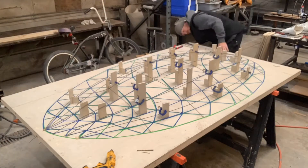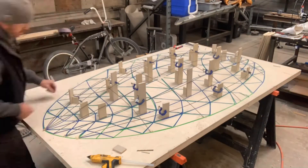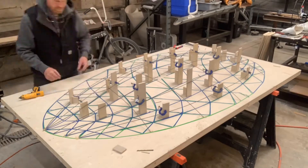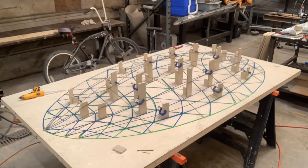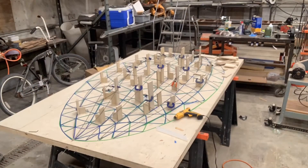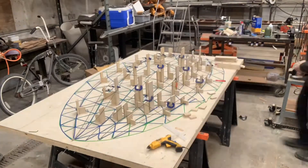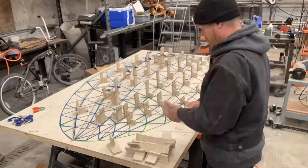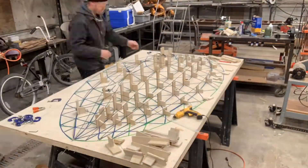Here I am putting an eighth-inch rod in arcs to create the three-dimensional shape. They're being held up by those pieces of wood and then adjusted by the C-clamps. So now that it's adjusted, I'm gluing pieces of wood underneath the vertices there, where the lines cross each other, so that when I screw in the little buttons at the center of each of these triangles or circles, there's a piece of wood to screw into.